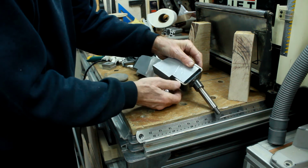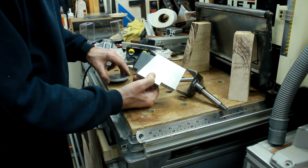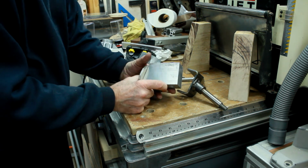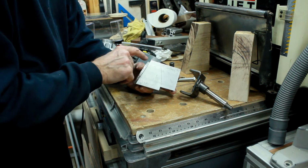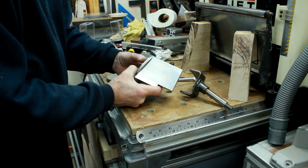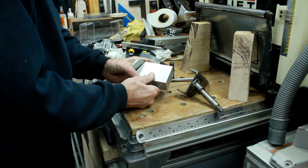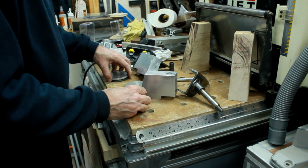Let's get one out. Now I've got to round over those ends, and I may well then round the section here where it mates to the vertical plates. That needs dressing smooth, flat, drilling, tapping to take countersunk bolts going in that way, and as I say, I may well just round those over and or take some more of that bottom off. I'm not sure yet. The critical bit was getting that size there, and the rest of it now on can be art rather than mechanics. So we'll move on to that perhaps in a future episode. I think we'll stop this one there at that point.